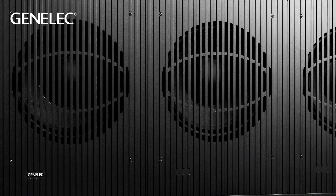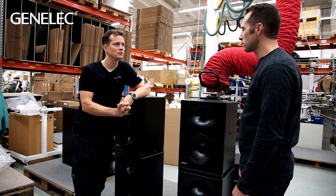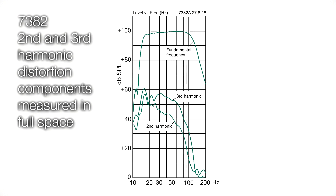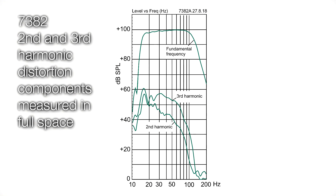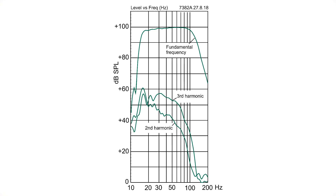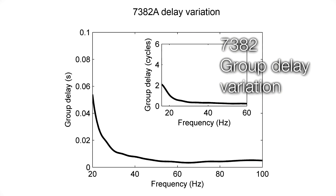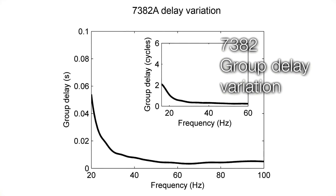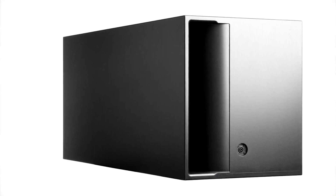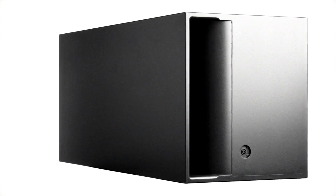It's been a long work with the supplier, but really fruitful — we've been able to bring down the distortion levels a lot. We've chosen not to put it in a spiral cabinet this time, but in a squarer box, which is easier to put into a room. At this size, a spiral is actually quite impossible to make. Instead, we've made a more conventional port design with large roundings and flaring in the port, so we're able to get distortion-free low end through the port as well.